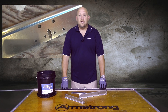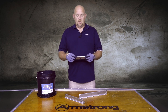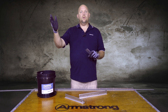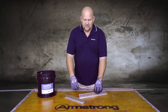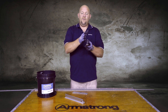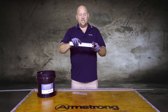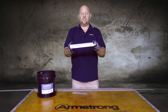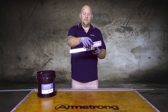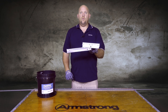The SH-12 is specifically designed for acoustical grid. The whole purpose of SH-12 is when you're trying to free float or support a perimeter trim of some sort and it's perpendicular to a main. Right here I have a main. If I want to support perpendicular to the main where I have a cross T, once the cross T is engaged, what happens is the cross T becomes flexible. If you take the SH-12, you slide this in over the actual peak form of our grid.